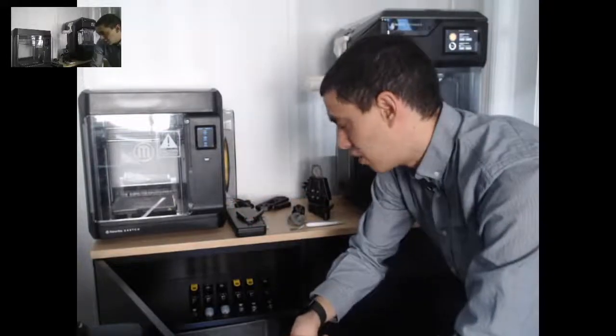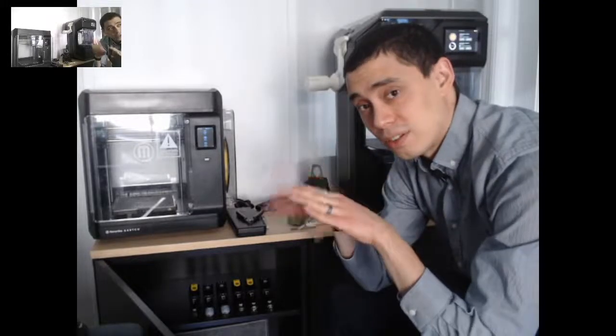want to have dedicated tool heads and extruders for the printer, just because essentially, each material type will heat up to different temperatures, and in doing so, you will leave behind a little bit of debris of the material. So let's say you're printing with ABS at, say, 250 degrees Celsius, and later on you're printing with a less heat intensive material like PETG, right? That temperature difference means that whatever debris is left after the ABS printing process is complete will not be melted out by the next material, unless the printing temperature is higher in the new material.